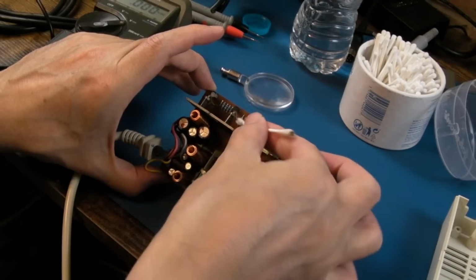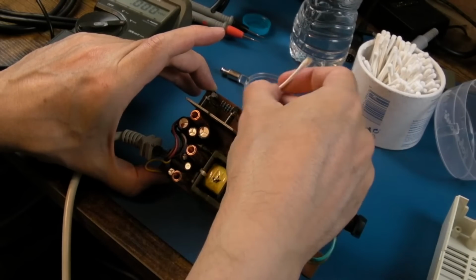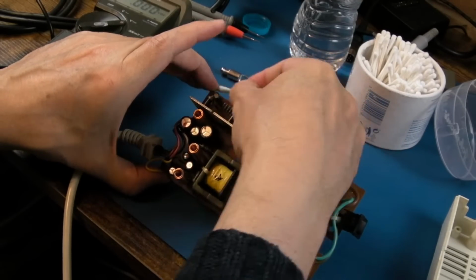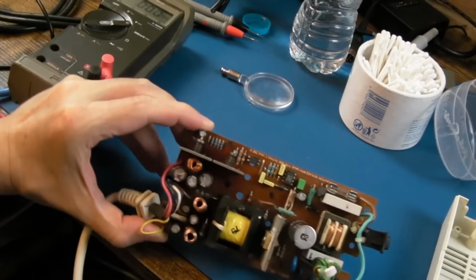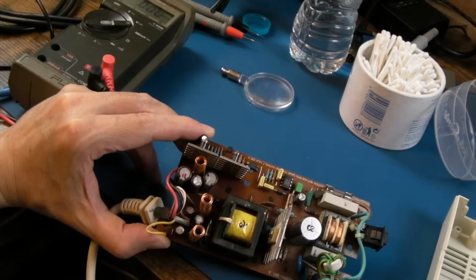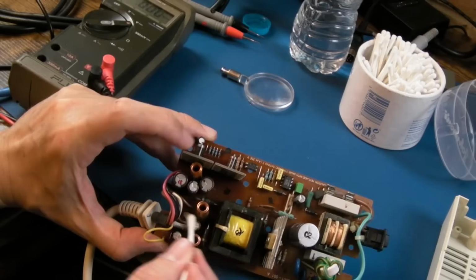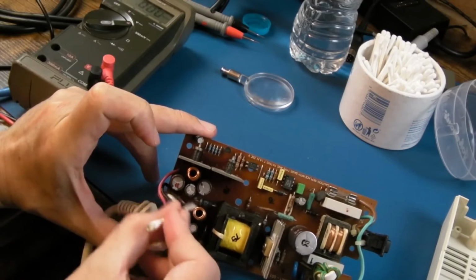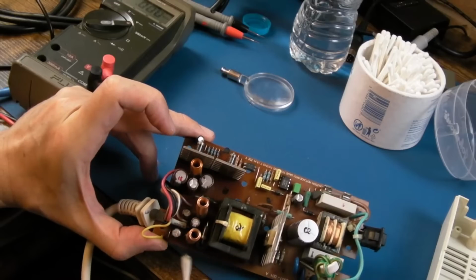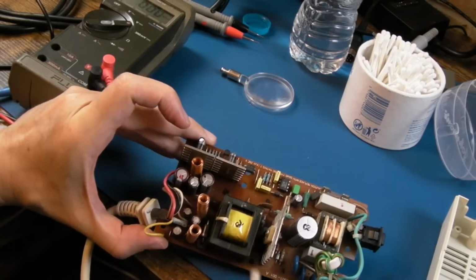Certainly with something like a TF1260, but with a TF1230 or something equivalent in 030, you might be alright with one of these power supplies. I think the one thing I would say is, because it's onto the smaller capacitors here, the same sort of size, well, these are a bit smaller, 1000 actually. I think I'd be more inclined to always recap this model, just based on the fact that these caps may have been super stressed, because they're packed in pretty closely there, and they're physically small, but also small in capacitance as well.